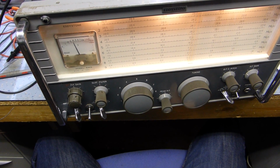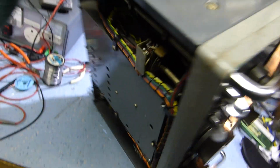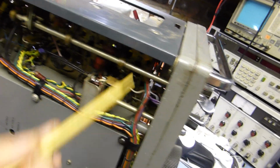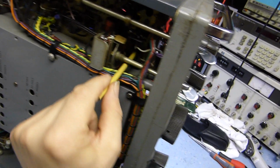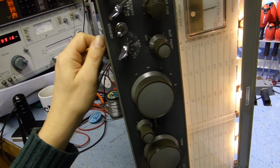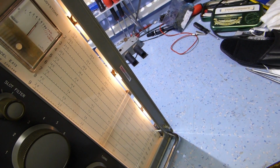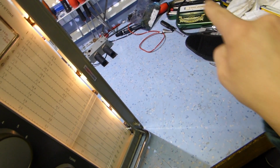There's one there, there's a null, just at 98 kilohertz. Okay, I think I'm going to have to turn the radio up and have a twiddle about with that other transformer to see if I can get that better, because that's going to affect the performance of the whole radio. If the IF's got a double peak as big as that, and it's not even a small one, it's quite a marked peak. This is the transformer they say to use to try and prevent that. Oh, that's better. It's like I've got a long flat plateau on it now.